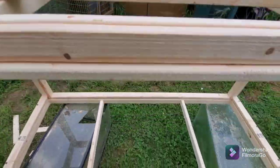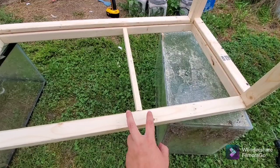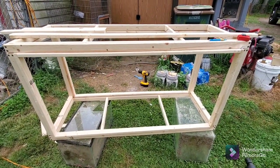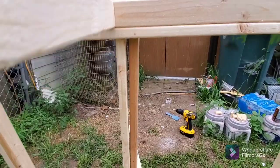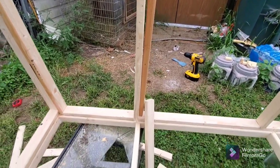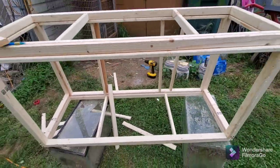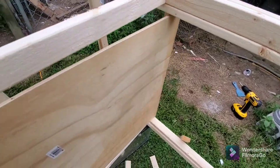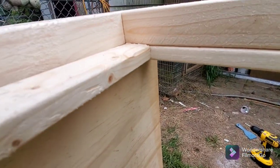I got both sides done. Next you want to measure from top to bottom for your bracers. I'm gonna have a divider, so I'm gonna have two braces next to each other but not too close so the board can slide in. I gotta do two, four, six, eight — four for each side. The divide is gonna be a space however thick your divider is. If you're not putting dividers, just put a brace in between so when you mesh it you have something to staple to. Before you wedge it in, you might need a longer screw — definitely pre-drill it, otherwise it'll split.